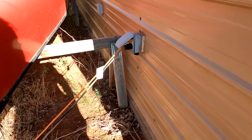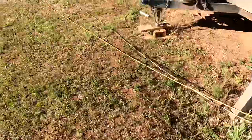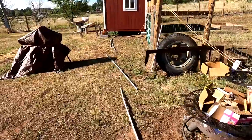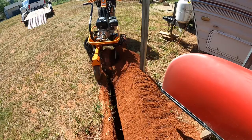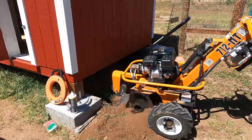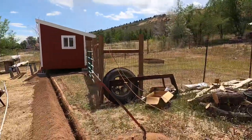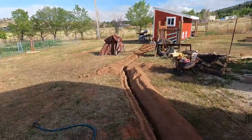Underneath, you'll see it taped up — I've got a three-quarter inch fitting for conduit. I'm going to trench a line all the way through here and over underneath the left-hand corner of the chicken coop. I have the conduit in the ground and the wire through the conduit going from the back of my shop out to the chicken coop.